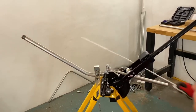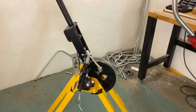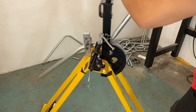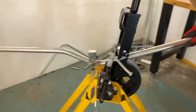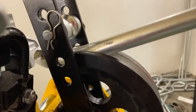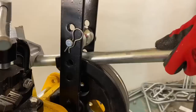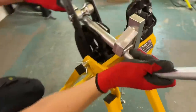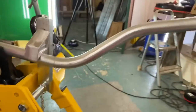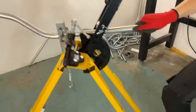We're going to bring that fixed rule in and work out whether we run parallel with the line we haven't bent yet. Drop that one onto the line and then check if those two run parallel with each other — that's the tricky bit. That looks not too bad. Nothing like being lucky sometimes! Now we reverse it — we've got to try and bring the next bend in parallel to where that one was. We can already see it almost. We've turned it around 180 degrees so we can see that mark, and that's going to run off the former.